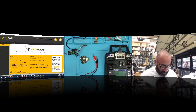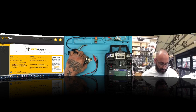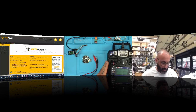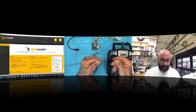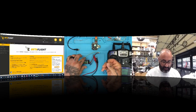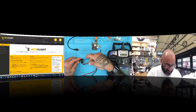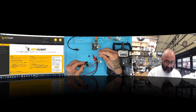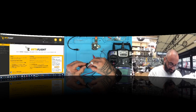I'm back — I actually swapped out the board because I noticed something on the old one and wanted to get a clean readout. I was looking for a jumper cable but couldn't find one, so I grabbed a female-to-female servo cable instead. I'll plug one end into the receiver's binding port, leaving the middle pin untouched. I also added back channel five and channel six cables.